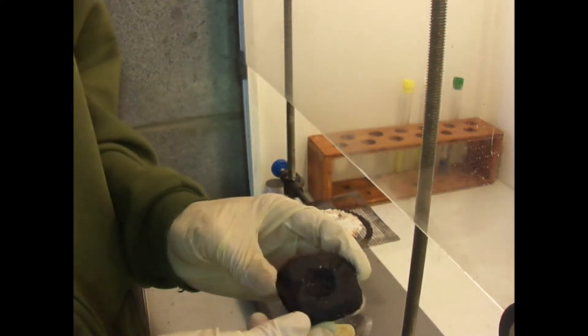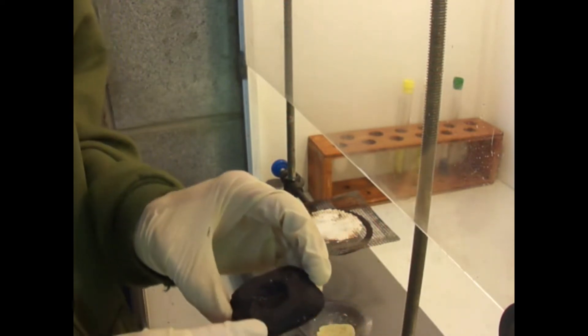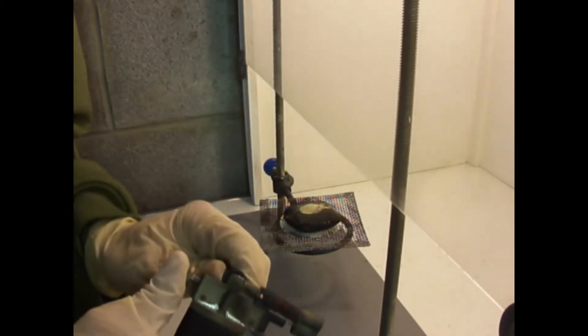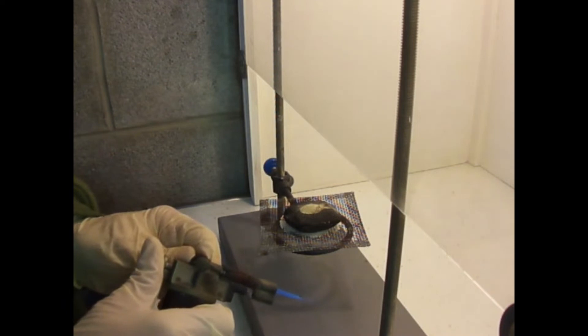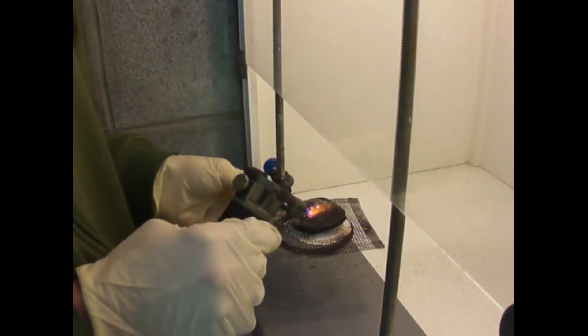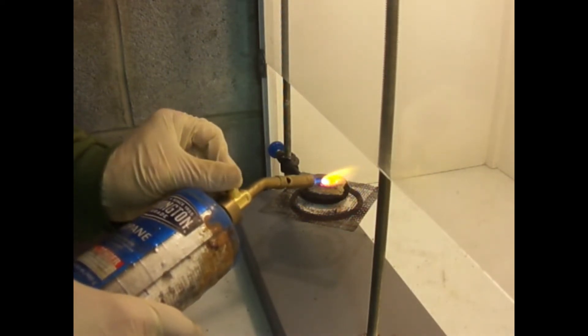We should have a really good mixture of the flux and sample in really good contact. I'm supposed to use a charcoal block with an indentation for the sample to sit in — I'm actually using a charcoal briquette, which will work just fine. You put your flux-and-sample mixture into that indentation. You first melt it and then hit it with a strong flame to coalesce the lead globules together, but you have to be gentle because the material tends to want to blow away. It looks like I have it all melted, so I'm going to start heating it with a very strong flame.